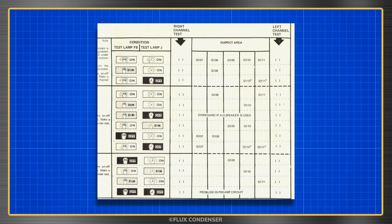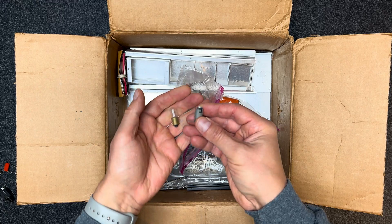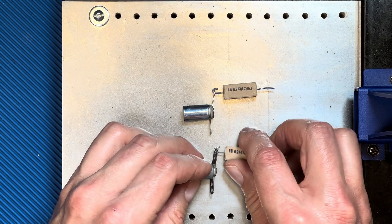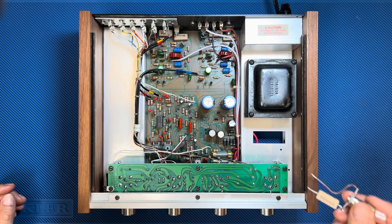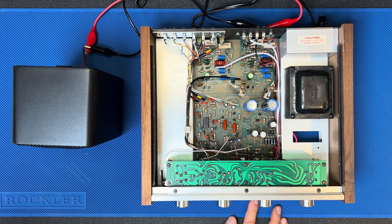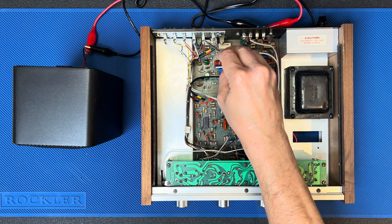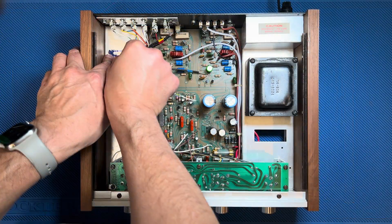Once I completed construction, Heathkit called for a simple test procedure. You may recall from the first video that during unpacking I came across a couple of incandescent bulbs — those turned out to be used for testing the amp near the end of the build. The manual had me build test fixtures from two bulb sockets, two power resistors, and two bulbs, temporarily installed at the test points of the main amp board. First: press the power switch — the front panel LED lights but the two test lamps do not. Check. Push the speaker button — you hear a hiss, neither lamp lights. Check. Place a screwdriver on both phono inputs — speakers produce a loud hum and both test lamps light. Check. The serial number sticker was then installed, test lamps removed, and jumpers installed in their places.